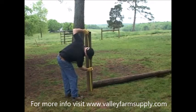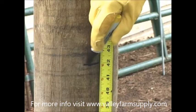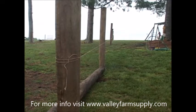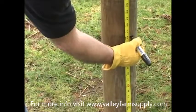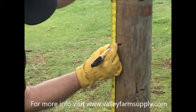These markings should, of course, face the inside of the fence. We then mark the post for the rail or horizontal brace post location at 42 inches, halfway between the top two wires. Another end post has been driven at the opposing end of the fence line. A tight string line has been run 24 inches off the ground. This line allows for post alignment as other posts are installed along the fence line. Posts have already been installed. Now mark the brace post for your insulators at 24 inches, 36 inches, and 48 inches, and mark the brace post at 42 inches for the brace rail, as before.